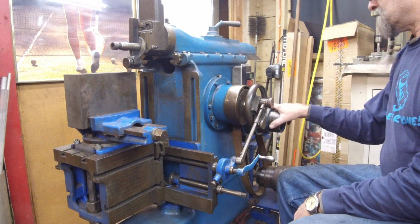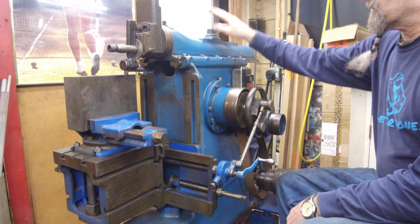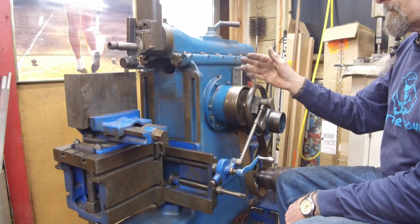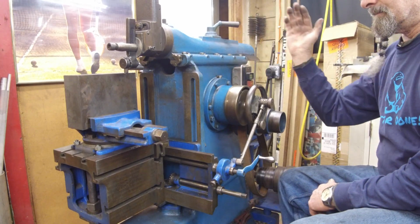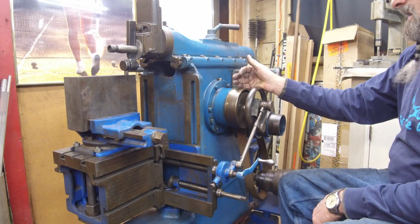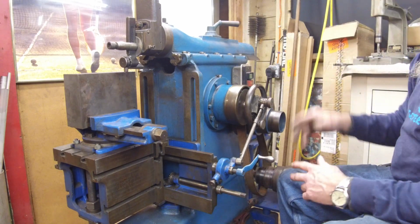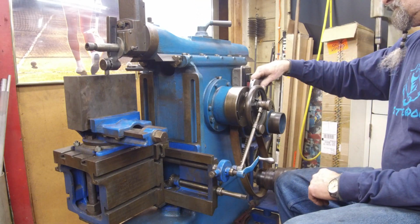So with that said, I got this in neutral. I haven't engaged the motor, so I can rotate this around. Position of ram is controlled by this handle up here, and the length of stroke is on the rotation of this hub right here in relationship to the arm. By rotating this, it puts the cam in the linkage so that the powertrain going back and forth is going to push this, and I'll give you a show of that through the window door on the other side once I get rolling. But right now I'm just going to tell you that I'm going to adjust it here, and there's graduations from 0 to, it only goes up to 9, but it has more to go past 9. We're going to be doing about a 9-inch stroke right here. So just this one nut right here.